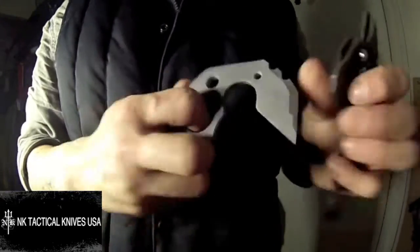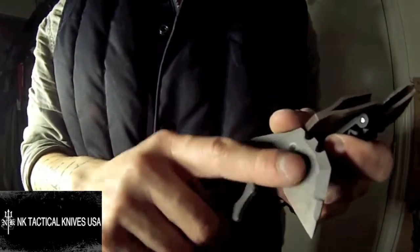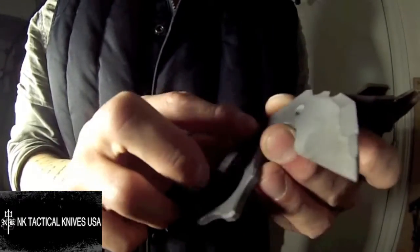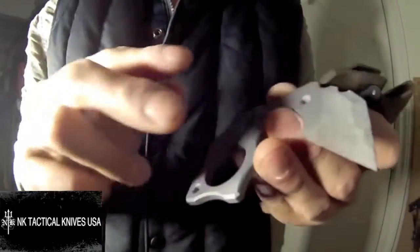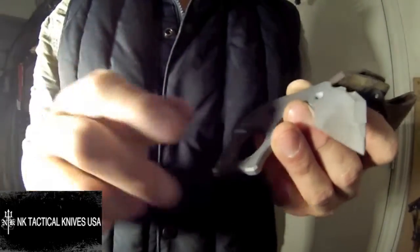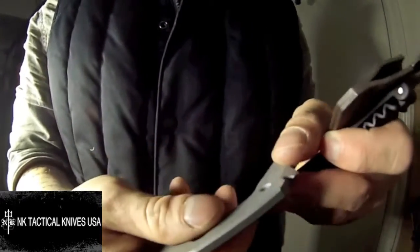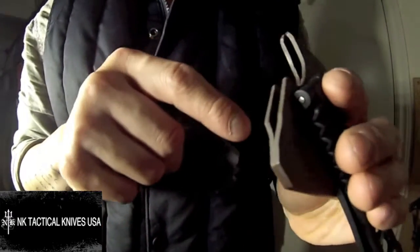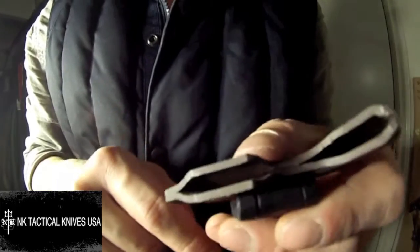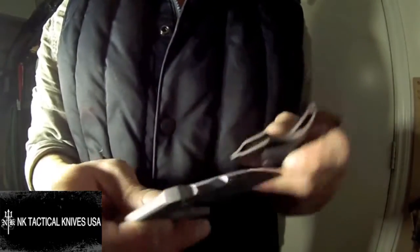As I make it, I'm trying to see where the Kydex scuffs the blade. You can see I didn't even spray this portion. The finish I applied — the traditional stone bead blast — is very coarse. It's meant for the highest amount of traction I can give you, and it has so much traction that it acts like sandpaper. Every time you deploy it, the sheath is being sanded away. That's okay in the beginning — you kind of get to see where the contact points are.